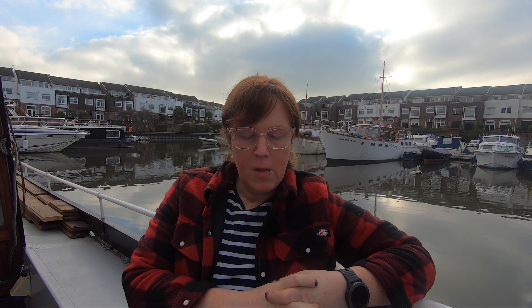I've started making a go at designing the circuit diagram for that system, which is this one. At the moment I need to work out the weights of the cables and the sizes of the fuses. It all depends extensively on how much power I want to draw from the battery. On board I'll have a macerator toilet, which I think is 15 amps, and a series of pumps. If I run all of those together it's not a huge amount of power, but I want to rate the system high enough to draw much more power. I might want to put more batteries in the domestic bank at some point, so it makes sense to rate it higher.